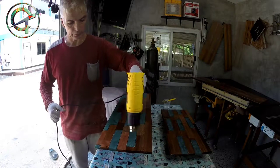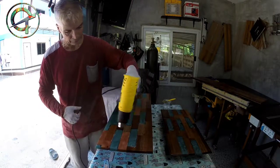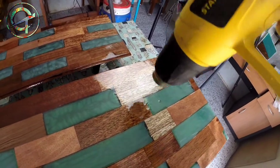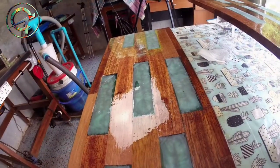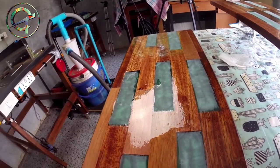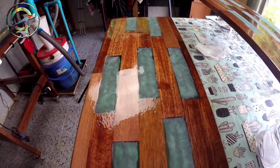The process will be repeated on the other side of the shelf. In the meantime, I blow air with my heat gun to eliminate bubbles forming. Don't worry about imperfections at this time — we are just applying the first seal coat layer.